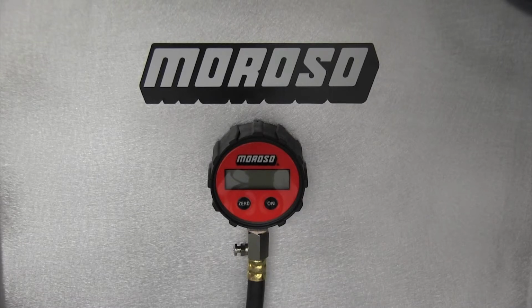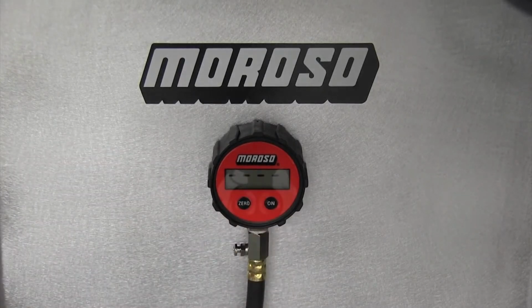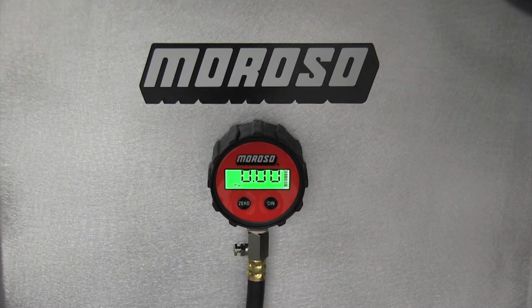So take the gauge out of the package, hold down the on button for about 2 seconds. When you release it, you're going to see that it shows 15, which means it's a 0 to 15 PSI gauge head. Moroso also offers these gauges in 0 to 60 and 0 to 100 options. On the right side, you're going to see we have full battery power. And on the bottom left, you're going to see we're in the pounds per square inch reading.